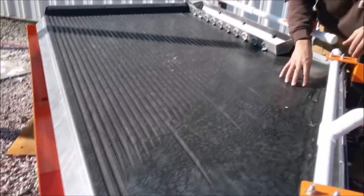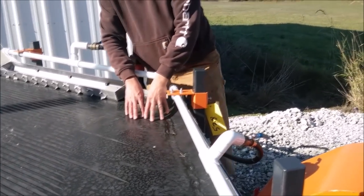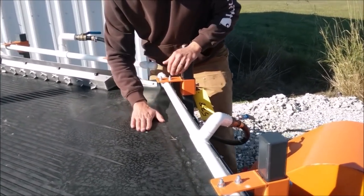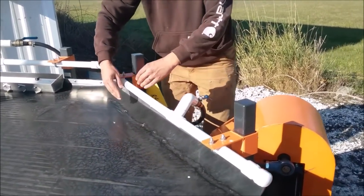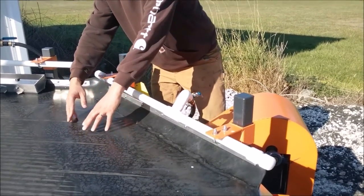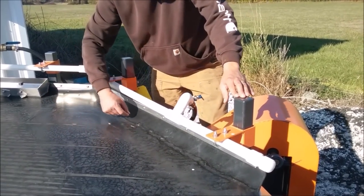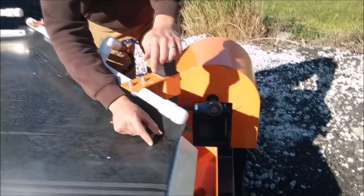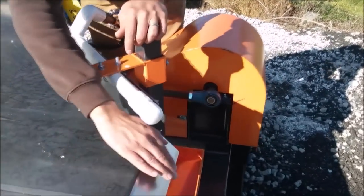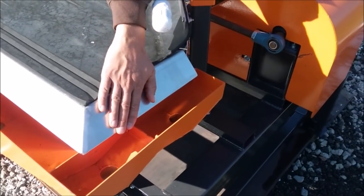Once the dense material is up past the ramp, there are no more grooves. That allows for the flat plateau up here to clean the material. The water will wash any less dense material away, and the gold or heavy metals will form a band right under this water bar, coming down into the number one or number two ports on our shaker table.